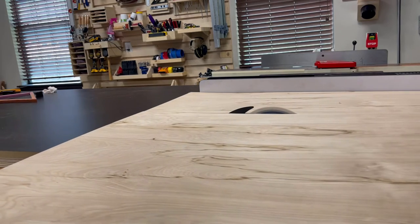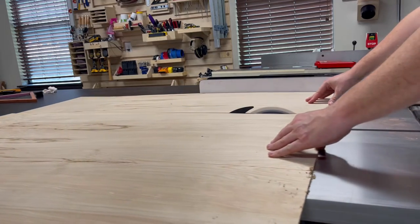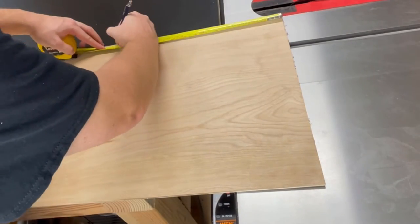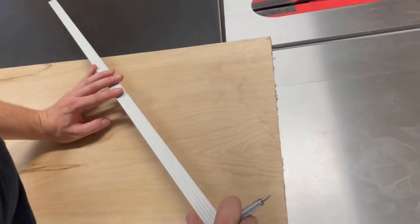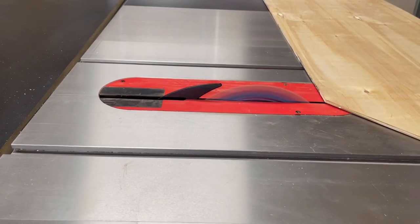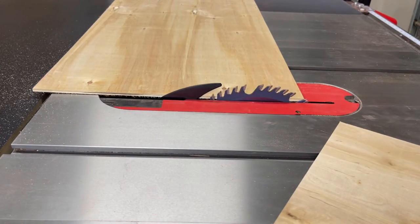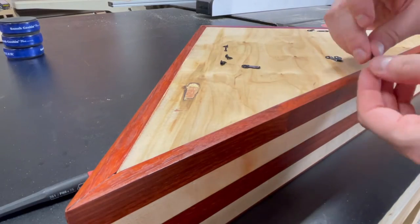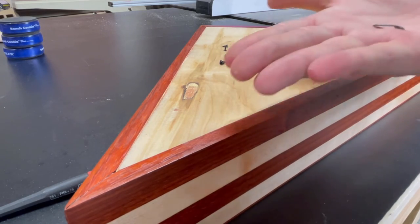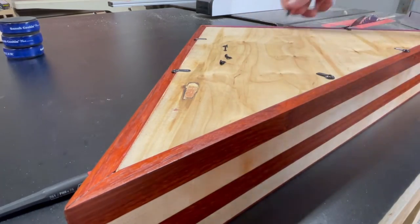To make the back panel that will sit in the rabbet, I'll be using some quarter-inch plywood. I take measurements from the inside of the rabbet on the flag case we've just glued together and transfer those onto the quarter-inch plywood, then use a combination of my jigsaw and my table saw to cut out the triangle. I installed some picture frame turn buttons to keep the back panel from moving, putting a little downward bend in them prior to installing so there's just a little bit of downward pressure to prevent the back panel from moving once the flag is in place.